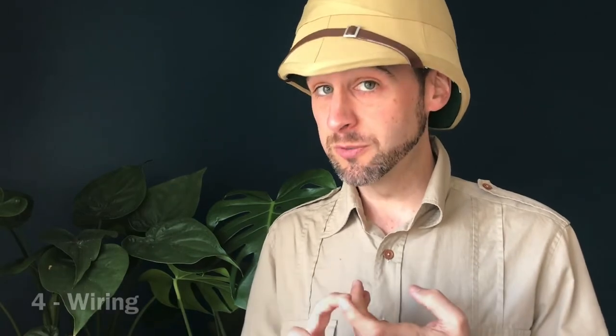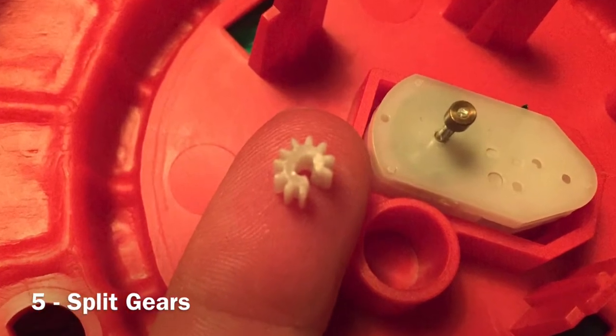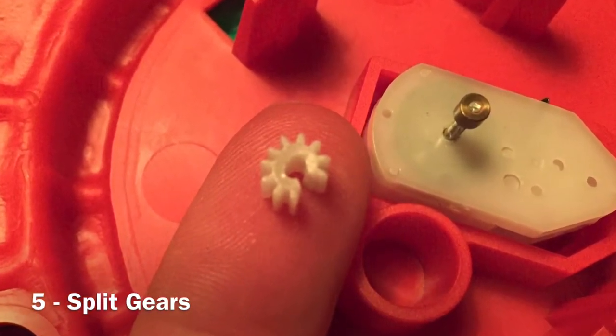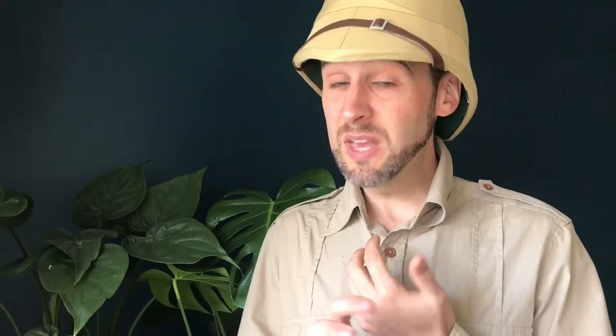There can be major corrosion which stops electricity from flowing from the battery into the circuit. If it's not battery corrosion, there might be a problem with the wiring inside — usually a wire has come loose and needs to be re-soldered. A lot of these vintage games have very small nylon gears which can crack or split over time, so sometimes those gears or cogs need to be replaced.